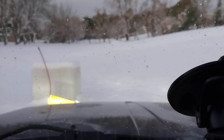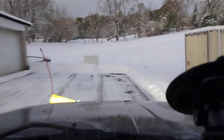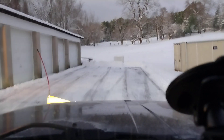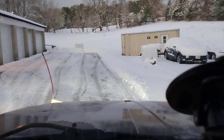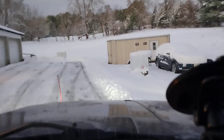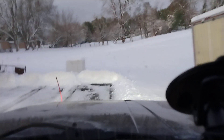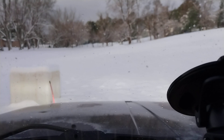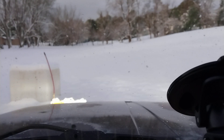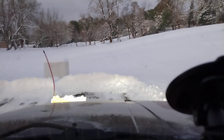I'm only using the blade for about two-thirds of its width. The reason I do that is because as the snow gets heavier there's more chance of tail off to the left. Now I'm sitting here — this is the last run I make on this section because that's all the wider it is. As we back up you can see this is now totally clear and it made a beautiful plow job.